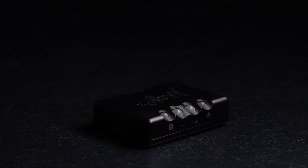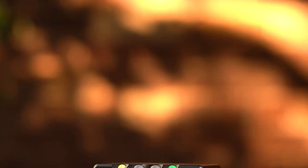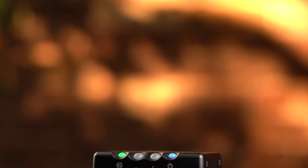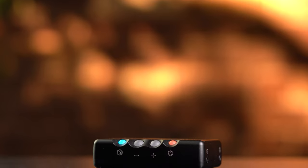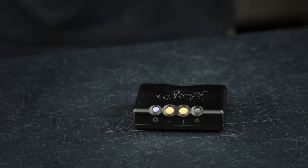Probably the most anticipated new feature of Mojo 2 are the four equalisation DSP controls. These allow the user to edit the frequencies boosted or cut in their audio by plus or minus 9dB per mode. The custom DSP core uses 104 bits and runs at 705 to 768kHz, enabling aggressive noise shaping and ensuring minus 301dB phase and amplitude accuracy. By using truncation noise shaping and 104 bits, we can ensure complete transparency by preserving the filtering of ultra-small signals.